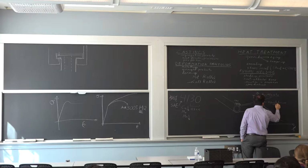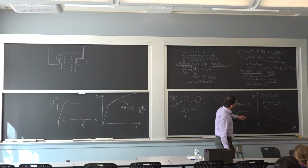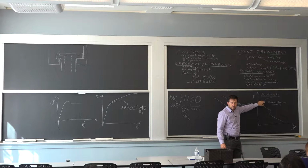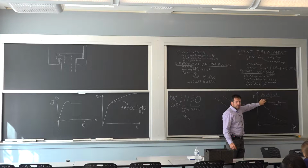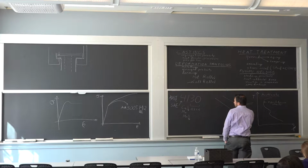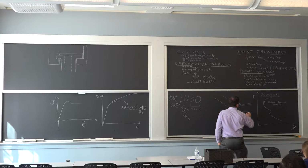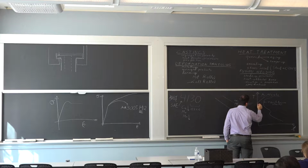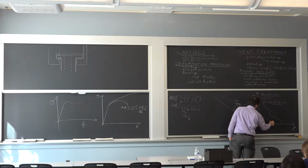Starts. And that's all because of our nucleation process. So there's a certain temperature decrease where there's a good combination of driving force from the thermodynamic and there's still enough energy to make it happen. So it will start transforming then. So essentially a typical 4130, the curve is going to almost cross the 0 time. So as far as beginning of transformation.